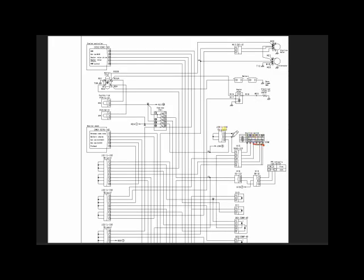From pin 14 those voltages go to other ECUs as well. So the main issue is that voltage is not reaching fuse 20. What I will do is take one wire from my key switch, put it here, and connect it directly to fuse number 20. This will allow voltage to reach the engine control unit and pin number 14 and all controllers. If my test is successful, it means the problem is in the wire.